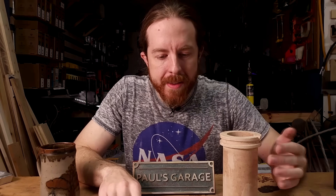If you do the math, that's about five pounds of a copper or bronze alloy, about a pound and a half of aluminum. Just don't fill them up to the brim for safety. If you're new, you really don't want to cast stuff bigger than that anyway. Start small, get comfortable, then upsize. This electric furnace is probably the easiest way to get started and I recommend it entirely for beginners.